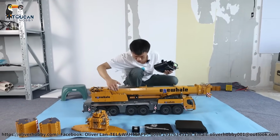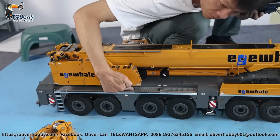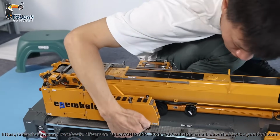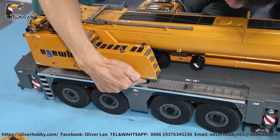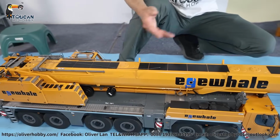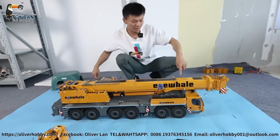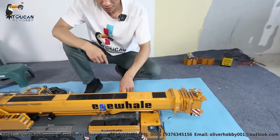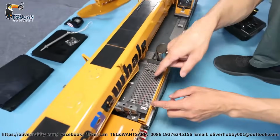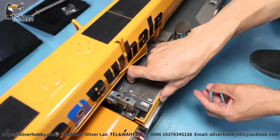So for the crane, this truck, here that's the oil tank, on top that's the cap, open it, fill up hydraulic oil. First can try 70 liters minimum. After we run all the oil tank cylinders out, we can fill up a little more. So now at this side, at the left side of the truck, here we can lift up from the front directly.